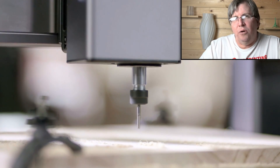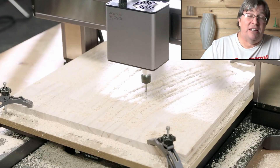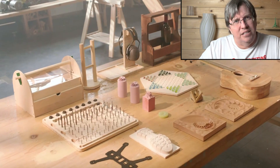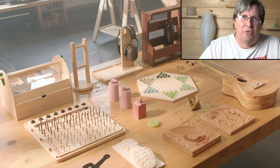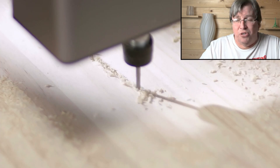It's also got a 200-watt CNC module, and it's really nice to have something that you can absolutely sculpt into wood and work with layers — all that kind of thing, which is slightly different to a laser. A laser does a direct cut, whereas this will allow you to do contours and all sorts of fancy designs with your CNC machine.